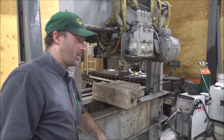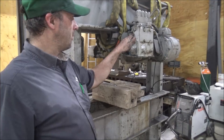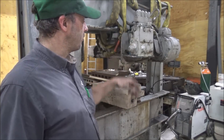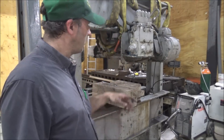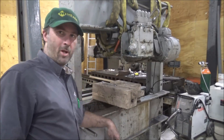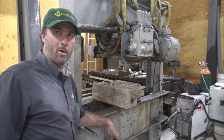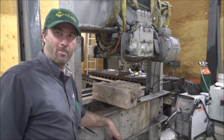I've got everything to where it's functional on here. At some point in time I need to see about what I can do - this rack shaft and this injection pump leaks oil when the level gets up that high. Right now it's not that high so it's not leaking, but when you pour oil in it leaks back out through here, so it's something that needs attention sometime. But now is not the time - we've got other things to do, need to work on getting this space cleaned out to bring the big Monarch in. Thanks for watching, thanks for subscribing, I'll catch you later.